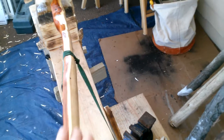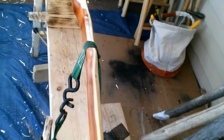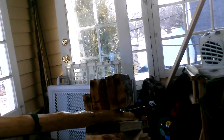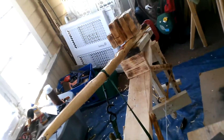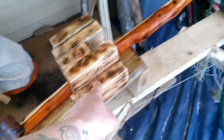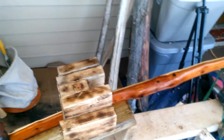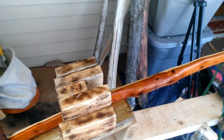See, that's straight and then this — you should be looking at it at this angle right here. I've steam bent this sucker probably five times getting it to bend sideways and it just keeps coming back. So this time I broke out the heat gun and heated it. I basically put it where I want it, then used a ratchet strap and strapped it down, put a vice on this end, and heated from right here all the way to the top of the handle. Heavy duty — I mean I really heated it. It was boiling the grease.